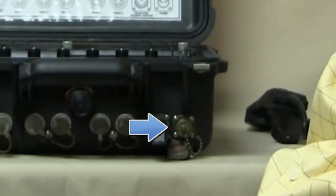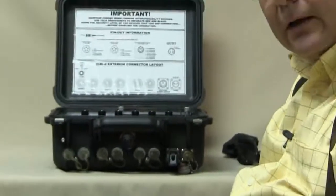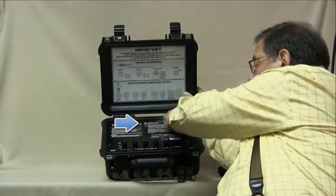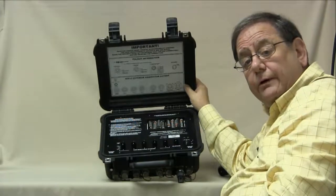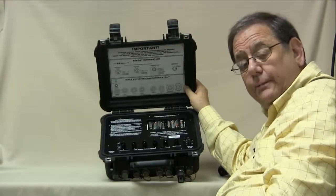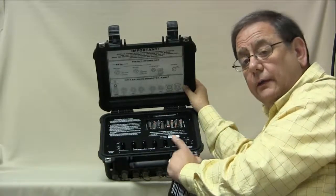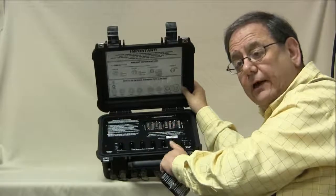The device can be operated on DC voltages from 7 to over 20 volts. If the unit has batteries in the compartment, it will run on those batteries for 30 hours. If external power from a generator or DC supply fails, it will automatically back up to internal AA batteries — standard alkaline AA — because the current drain is actually less than 100 milliamps.